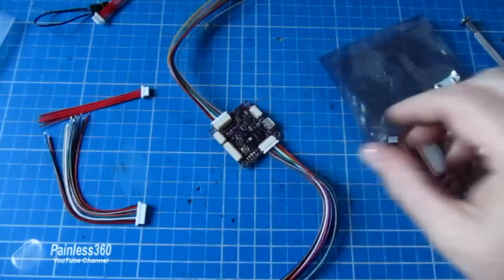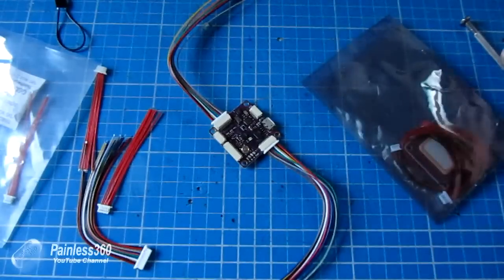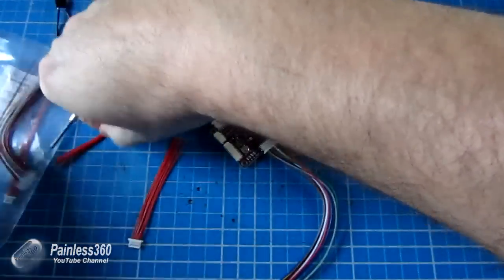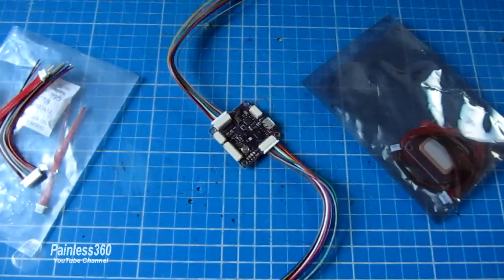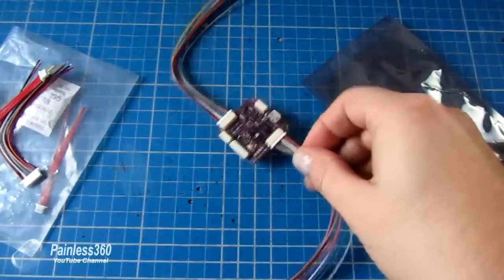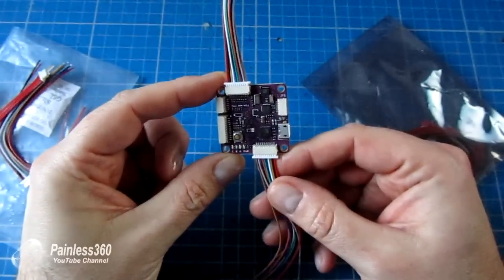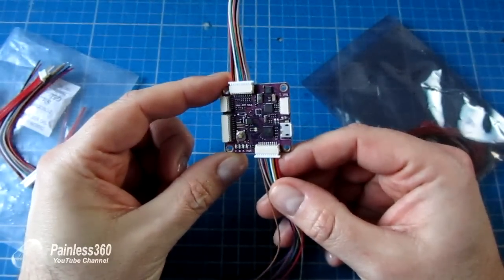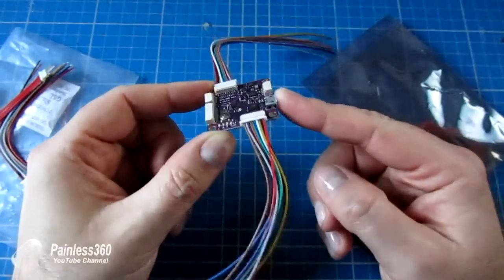So what I'm going to do is replace the first 2, installation and power, with 2 new videos for the APM 3.1. Because the wiring is slightly different, the way the power works is slightly different, and the way you connect it to things like the receiver and other bits and bobs is a little bit different too. Once we've done these 2 videos, the others in the series, arming modes, failsafe, log files, auto trim and missions, are exactly the same for this board as they are for the other APM series.